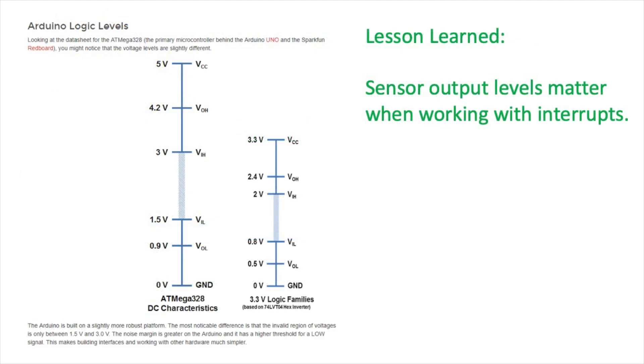The big takeaway from this experience is that you really need to pay attention to logic-level thresholds for the microcontroller you're working with if you intend on using sensors to trigger interrupt pins. I just assumed a wet sensor would trigger my interrupt pin and modem, but this may not always be the case — especially if there's some signal loss due to a poor connection, as I witnessed in my field deployment, or if the sensor just doesn't yield the voltage needed to trip your interrupt pin even when it's running perfectly.